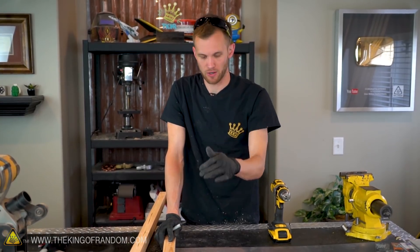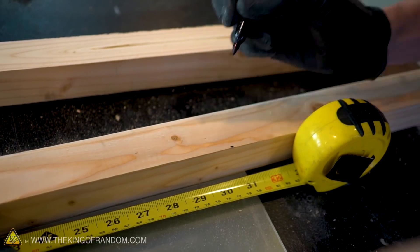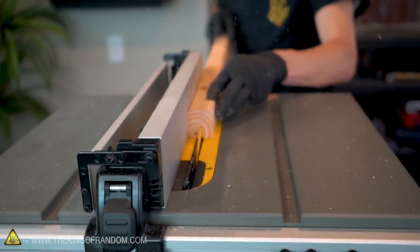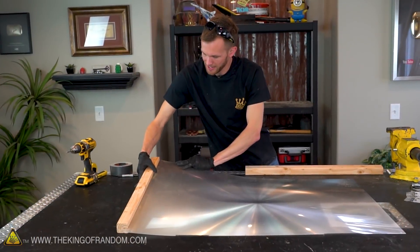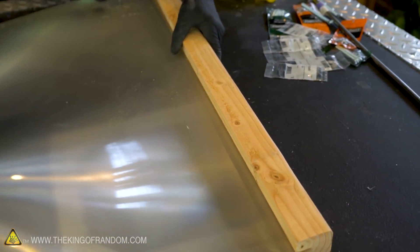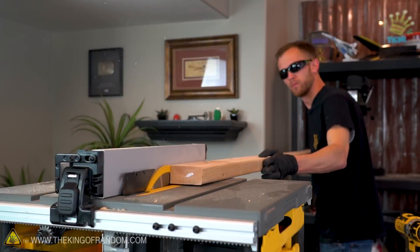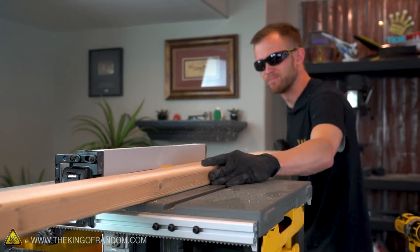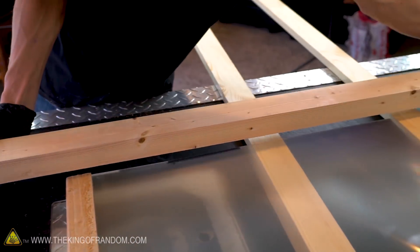I'll leave three-quarters of an inch space on the long sides of the Fresnel lens because that's where the wider part of the frame will attach. For the top and bottom we'll cut two pieces of the half two-by-four and cut a groove down each so it fits nicely onto the lens. These two pieces should perfectly house the ends of the Fresnel lens. The two-by-four is about the right width, but I want a nice square edge, so I've got the table saw set to just barely cut off that curved edge.